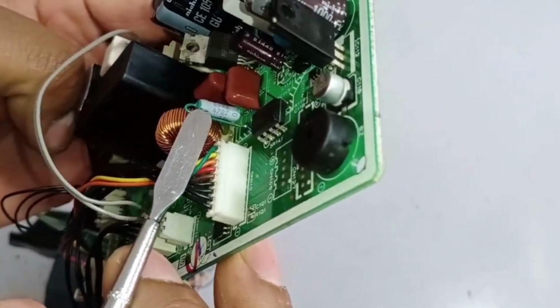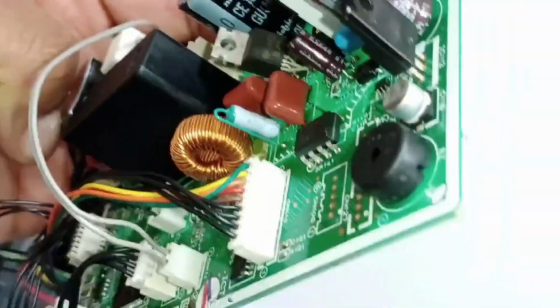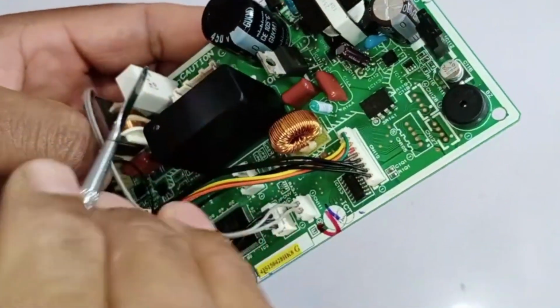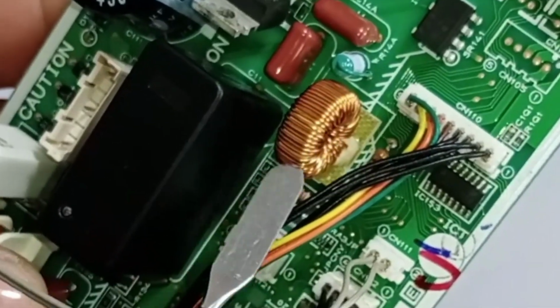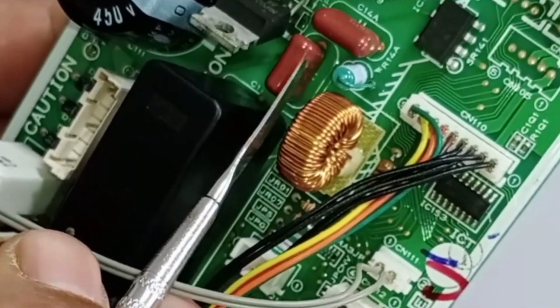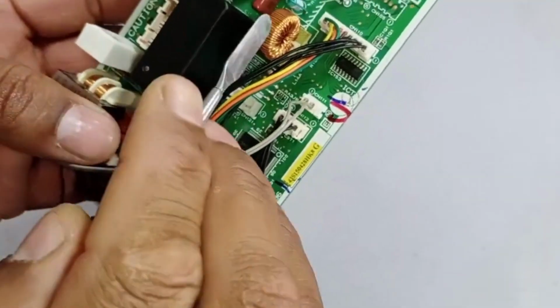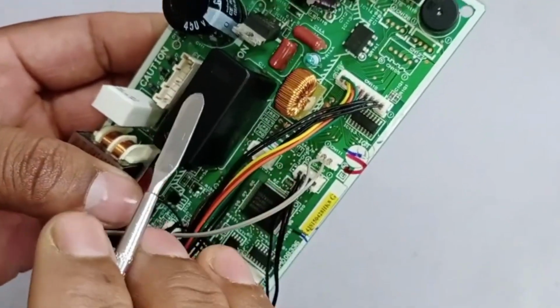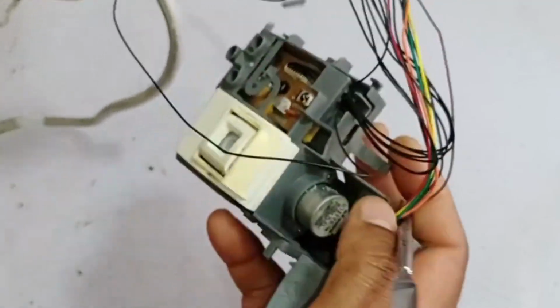It's a 47 ohm resistor. If there's any issue with the fan or a short circuit, this resistor will burn out, protecting the fan motor from damage. In addition to this, there is also an inductor placed here because a positive supply comes in. An inductor is essential for ensuring stable, efficient, and reliable operation by mitigating noise, managing current transients, and protecting the triac and the load.